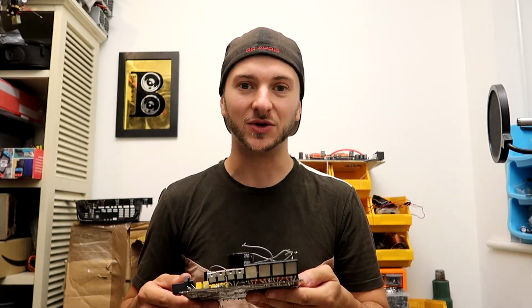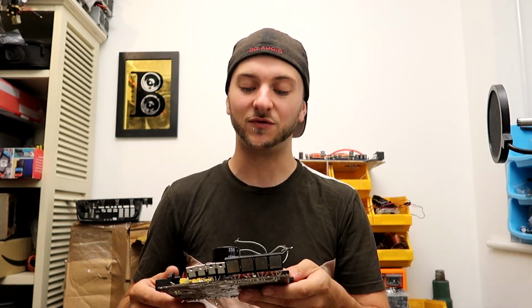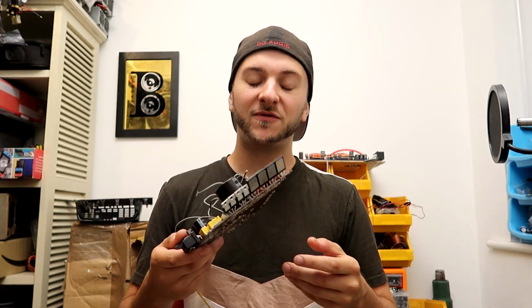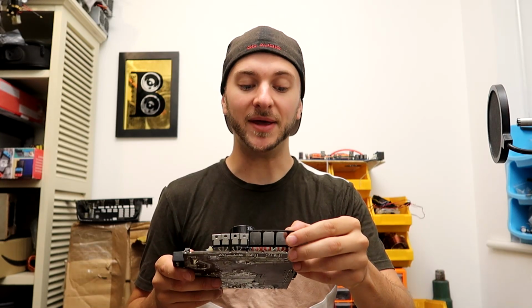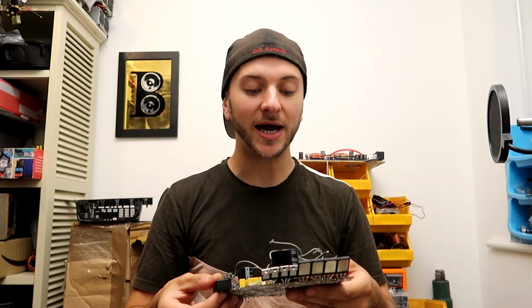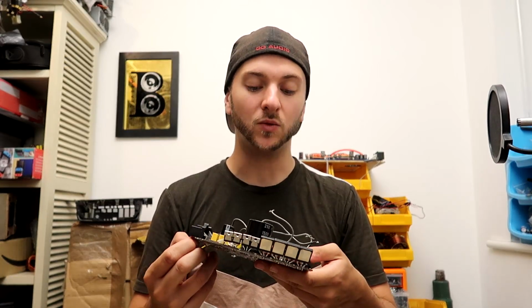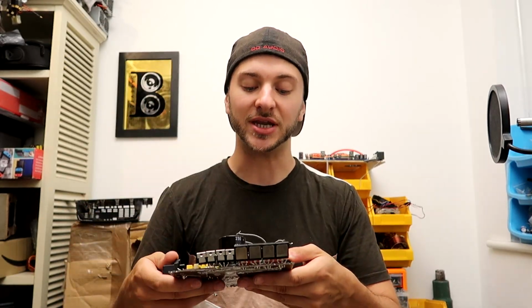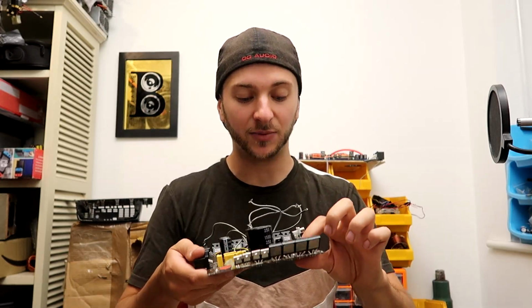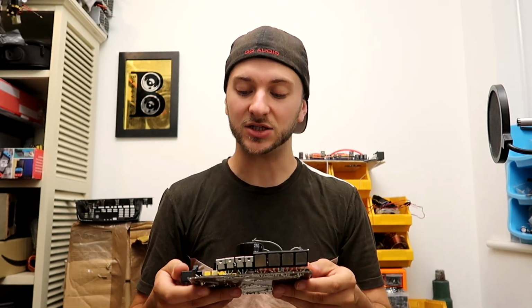But as I approached the 150, 160, getting towards the 200 volt mark, I did run into a couple of issues when the amplifier starts output oscillation. When the amplifier tries to start building the Class D switching on the output section, there seems to be a bit of a spike sometimes, and I did have a load connected at all times, but sometimes when it would try and power up and start oscillation, it would kill the IRS2092 drive chips, and a couple of times it killed the 15 volt Zeners as well.